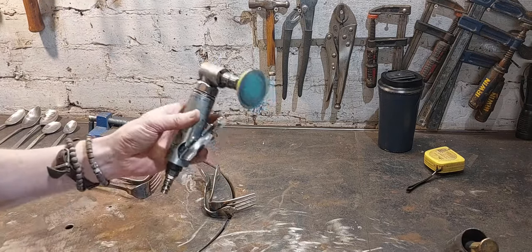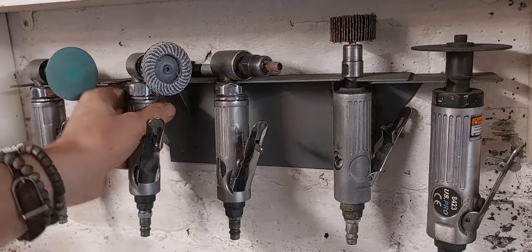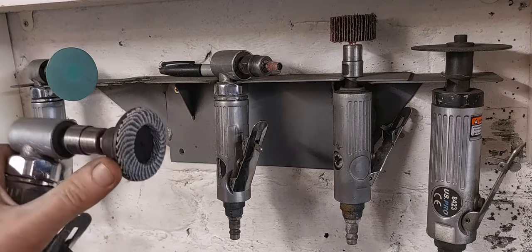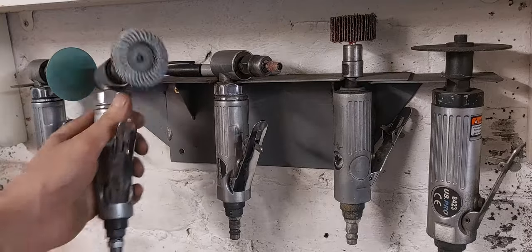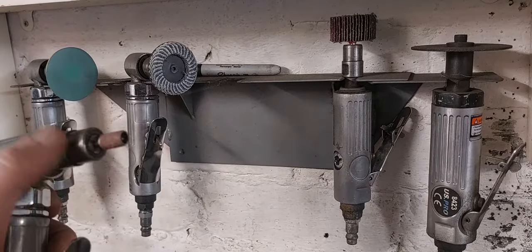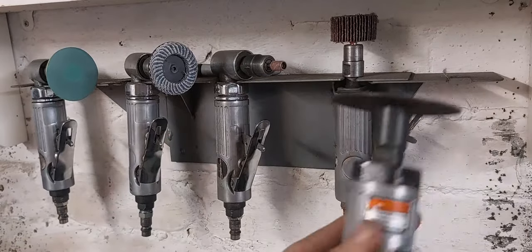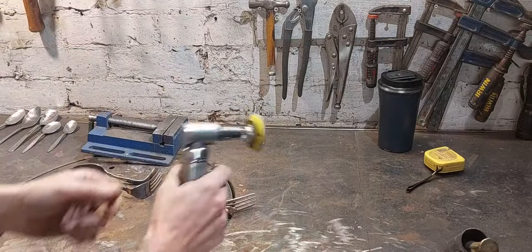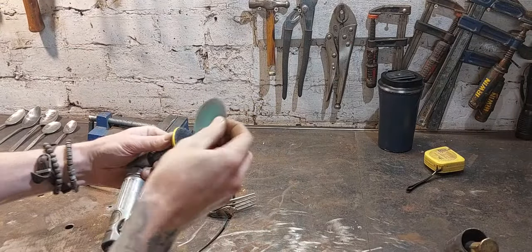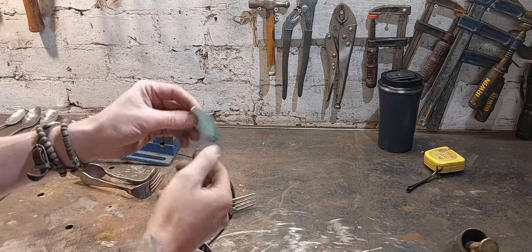one of these. So this is a die grinder, really useful little tools, from fine sanding to this is a flat disc. It's a much more abrasive thing. That's for sort of cleaning up welds, getting them down to a smooth sculpted shape before polishing them. Little sanding rolls, very useful. Much more abrasive for sanding things like that, or even cutting discs for, well, cutting things in half. Pull the trigger, this spins around at high speed, and you can use various different grits of very fine sanding paper. So for example, this is 320 grit, that's like a very mild sandpaper.